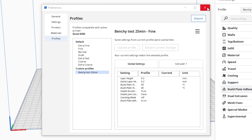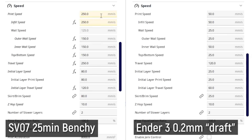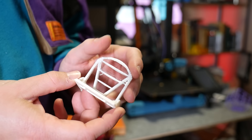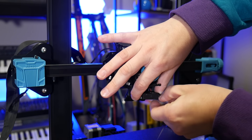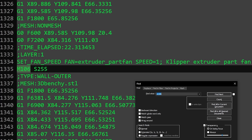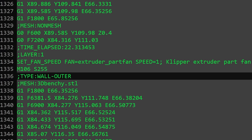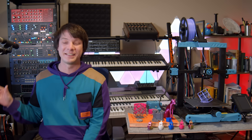When this machine arrived, no printing profile was provided and I had to harvest it from the Benchy G-code in Cura. The PLA wasn't cooling quickly enough with my own models, and I realized that huge blower at the back wasn't spinning up. It turns out the command to enable it isn't the usual G-code cooling fan command M106, but instead requires a completely custom command: set_fan_speed fan=extruder_part_fan speed=1 to turn it on and speed=0 to turn it off in Klipper. My guess is that engineers just manually added it as a last-minute addition to the demo G-code for the Benchy and shipped it.